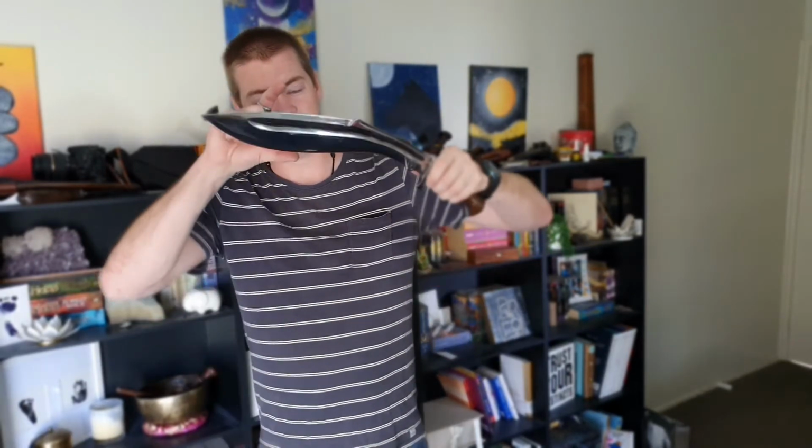Now, the really cool thing about this is that the top of the bevel, as we're moving up the blade here, is thicker than the spine by about 0.5 millimeter to 1 millimeter. The reason is so that when you're actually chopping through something, the blade's only going to bind with the wood to the top of the bevel. And then after that, there's nothing stopping it from going through. But all of this spine and fuller and everything is still here, creating an I-beam effect, supporting the blade. And that's really cool. So essentially it slices like a thinner blade, but it still has the broadness of a large blade. Once you use one of these, you'll understand what I'm talking about. It's really, really, really cool. And I'll be doing testing videos to show this soon.